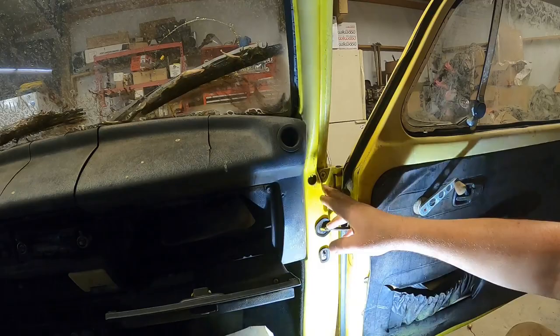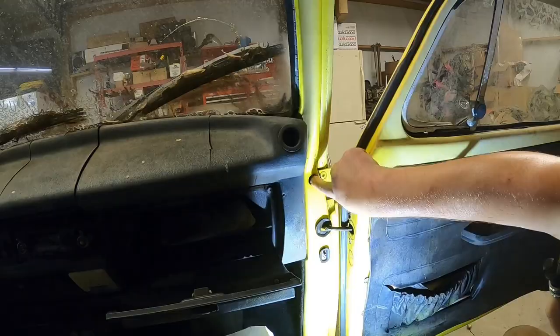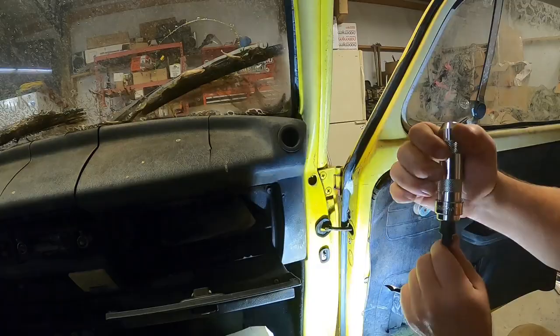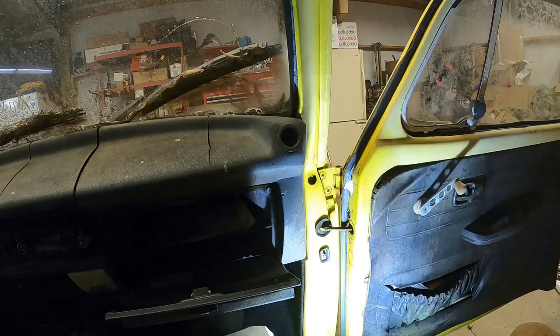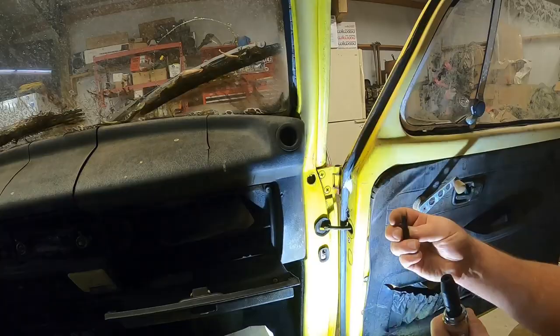Rather than using my little impact drill or an impact wrench, the thing with this manual impact is when you smack it with a hammer, it puts all that pressure in and turns. So hopefully you can get them broke loose and then back them out with a screwdriver. The way this works is you push in — it's got a little R and a little L. So righty-tighty, lefty-loosey. You push in, kick it all the way over to loosen, and it's got a little adapter that goes on there so you can hold your bit.